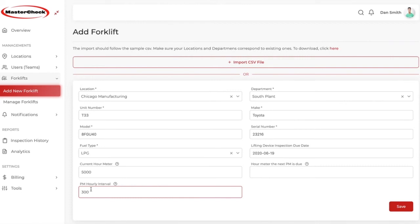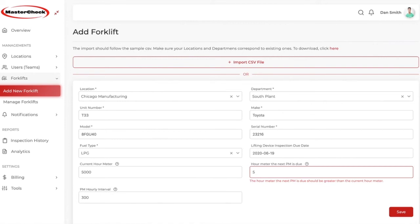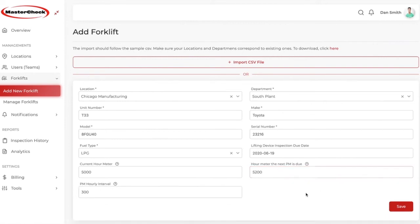In this example, we know that the forklift was last PM'd at 4,900 hours, so we'll add the interval of 300 hours to that number and input that here. Therefore, the next PM that's due is at 5,200 hours. Then, every 300 hours, for example, at 5,500 hours is the next one due, and then 5,800 hours, etc. We've now set up the PM hours, and I'll show you how to manage those notifications in the next video.